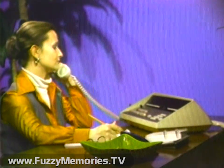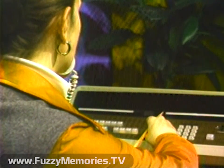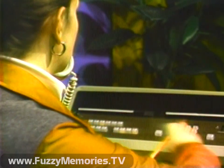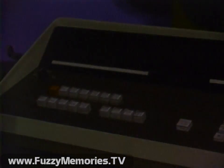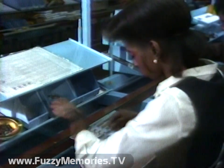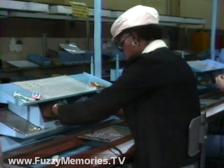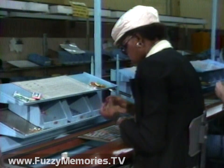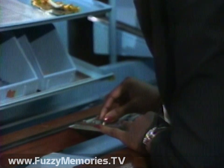Exaggeration? Not really — it's all just a matter of perspective. As little as 50 volts of static electricity can destroy a MOS device, so the system it's meant to work in will sooner or later fail. Just 50 volts. But did you know that you can carry about 3,000 to 3,500 volts of static electricity around with you every day? When unleashed, it can destroy a MOS device with the touch of a finger.